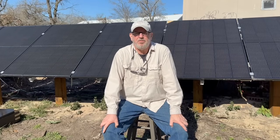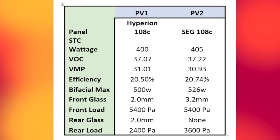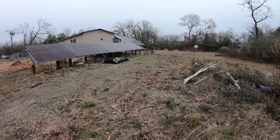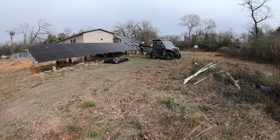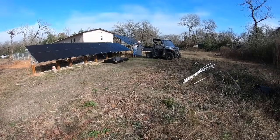To test these panels, I set up a comparison with my SEG 405 watt panels that are presently installed in my system. The SEG panels are also 108 cell panels with similar voltage. While they're rated at slightly higher wattage, the difference is only around 1% and I can adjust for this easily. We installed six of the Hyperion panels in the same array as six of the SEG panels. I've been using these SEG panels for over a year and recorded peak performance levels close to the maximum rated wattage, so I know they perform well throughout the year.